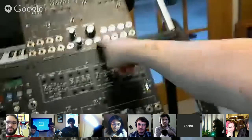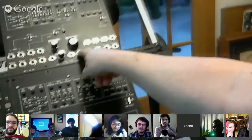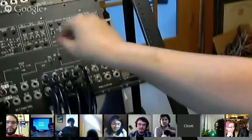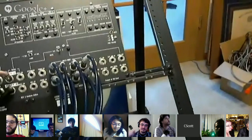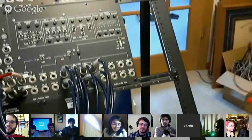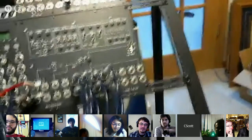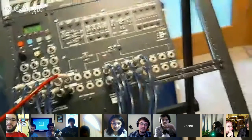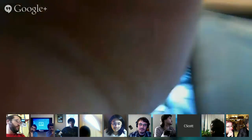This is the first one I built. Right now it has a test board in it. I'll pull it off here in a moment so you can see what I'm doing. But it is fully analog. There is no intelligence in it whatsoever other than a little digital noise generator PIC chip and 1 gate package to help with some of the waveform select switches. This is why you see this 4-channel MIDI CV and gate unit connected to it, which is connected back to my studio here.